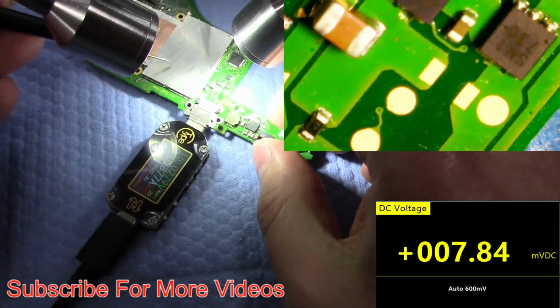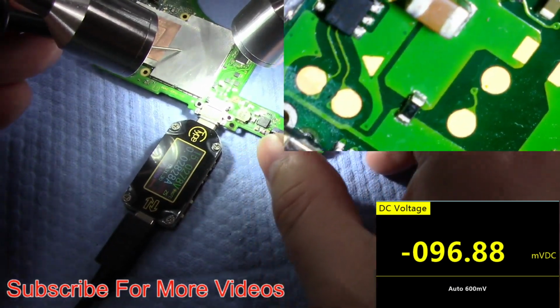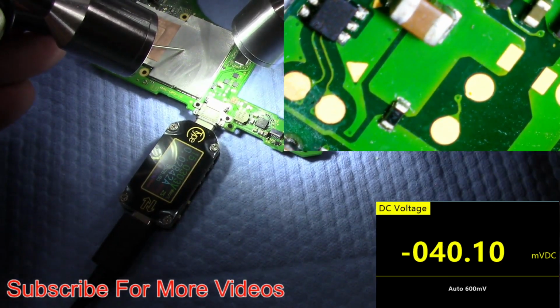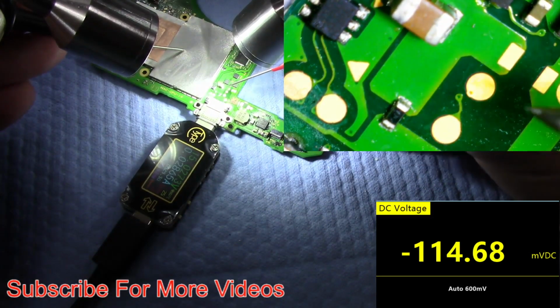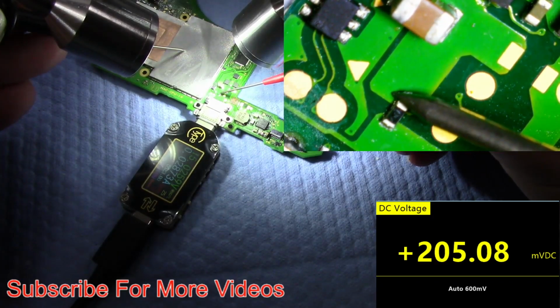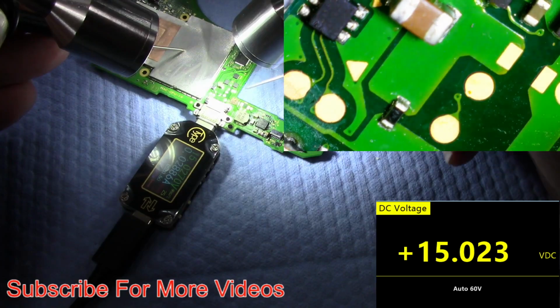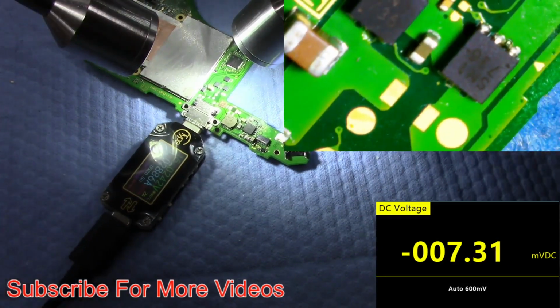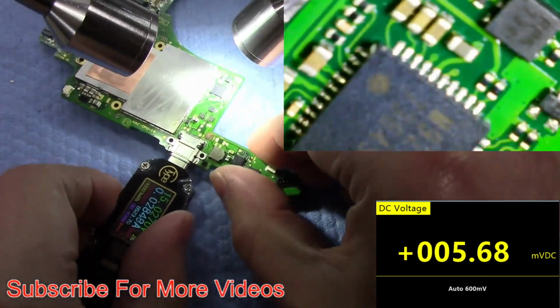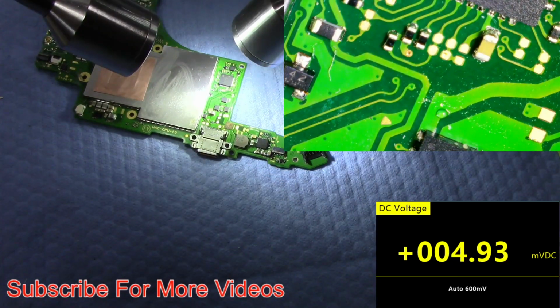So let's go to volts DC here, and let's check that fuse and see what voltage we have on that fuse here. If we look on the other side of that fuse, we have the 15 volts that the meter is giving us. So that immediately made me think that this chip right here was the culprit. But there's no shorted capacitors or anything around that fuse.